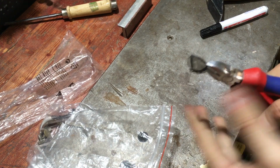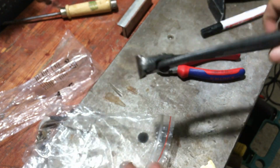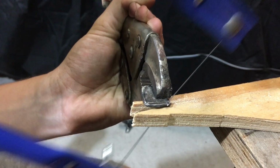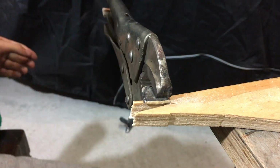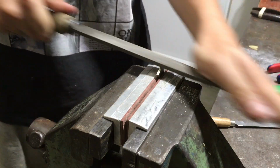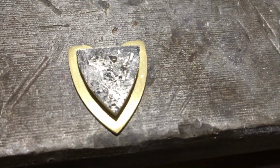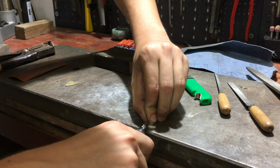Using wire cutters proved impossible though, because the hammering work hardened my piece. Even though I annealed it later on, I decided to switch to a jigsaw. Just like before, a great deal of filing was needed to get the outline right. Now for the first time did what I was working on kind of resemble the Ogmur. Next followed the meticulous job of getting the dome shape right.